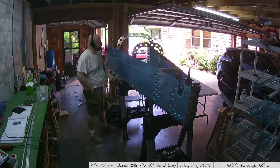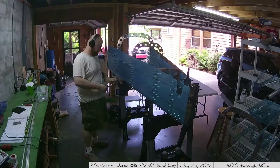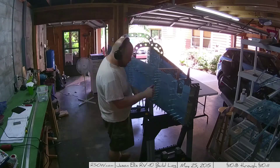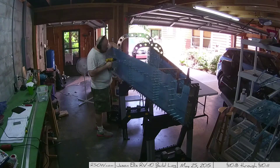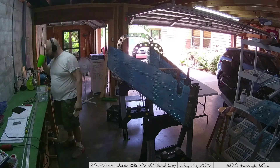Here I'm going through and beginning the drill-on-the-stiffeners process, just like I did on the other side. As you can see, I'm reaching over and adjusting where the line is. Remember, you've got a line along the base or bottom of the stiffener, and you want to drill along that line through those holes — that's what I'm doing here.